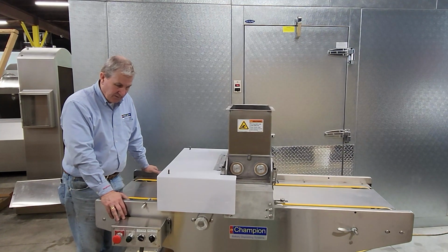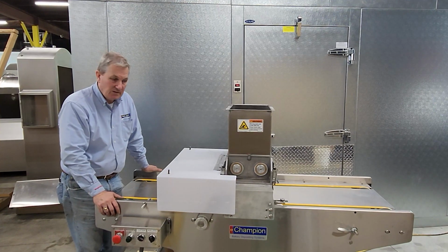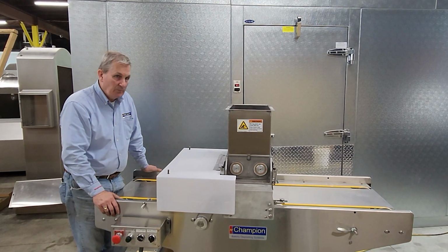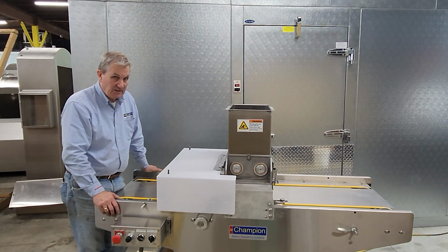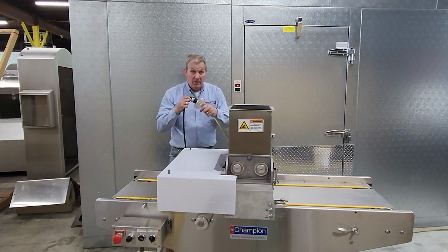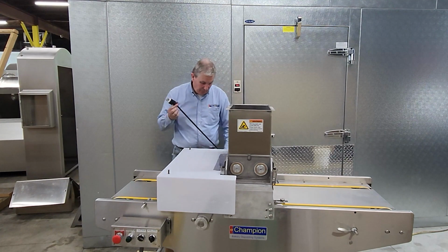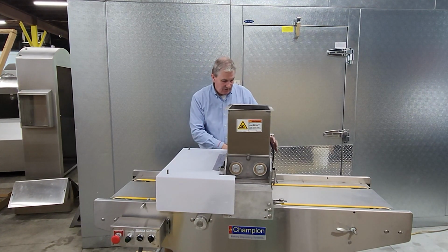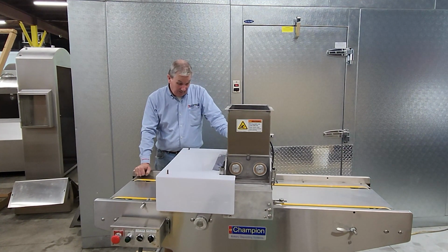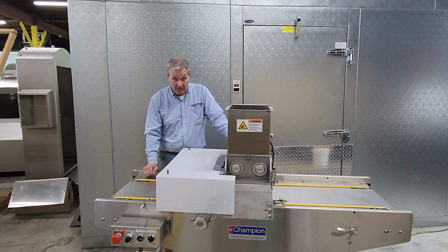That's an important first step, but we want to make sure that the machine is clean before you ever produce product for our customers. The first thing to do when you prepare it for cleaning, or begin to disassemble it in any way, is to remove all sources of energy. That's a requirement by the federal government and the Occupational Safety and Health Administration, OSHA. That's always good practice with every machine, to consider your safety and keep your fingers with you.